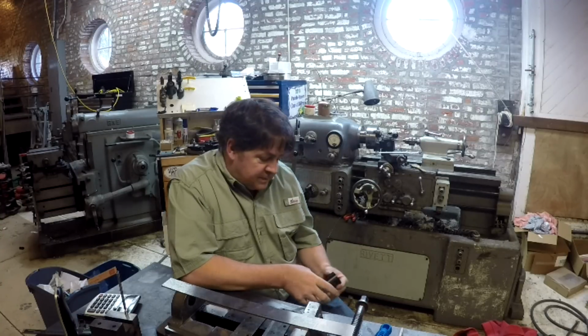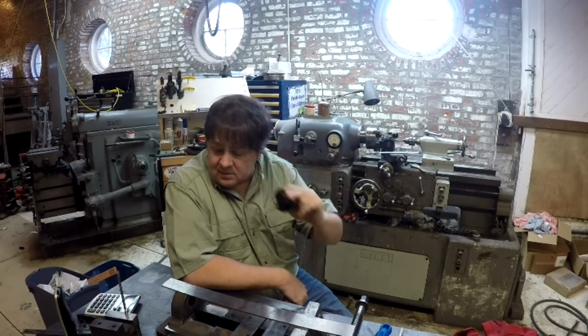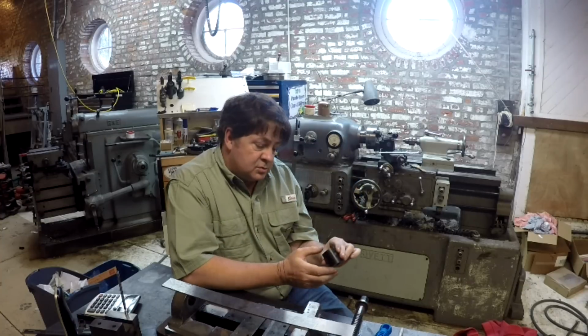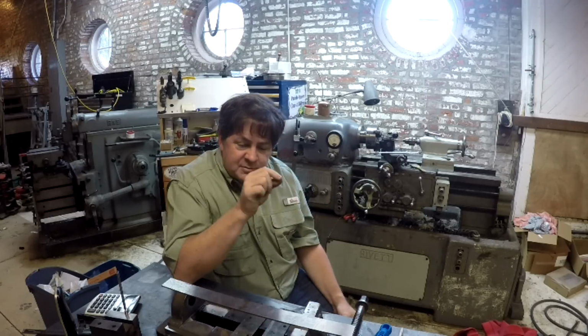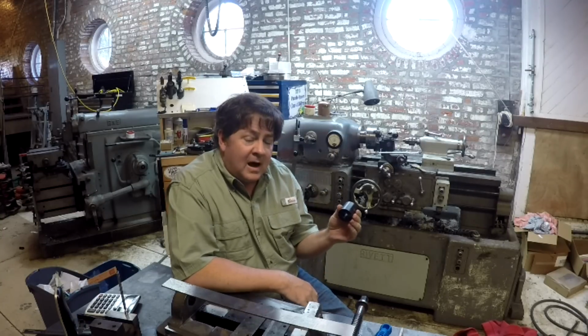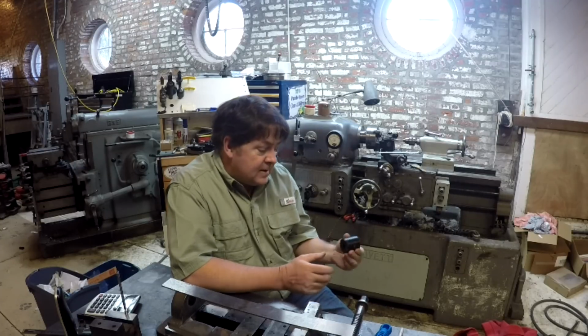So what I did was I took a piece of 2-inch black acetal here, and I bored a hole through the middle, 3/4 inch hole. By the way, the best type of bit to use for this is not a traditional drill bit, but a spade bit made for wood. Take a spade bit, cut the chip breaking tips off of the outer edges, grind them out, and go at it. Use a fairly slow RPM. You don't want it to get hot, okay? Hot meaning anything over about 250, 275 degrees.